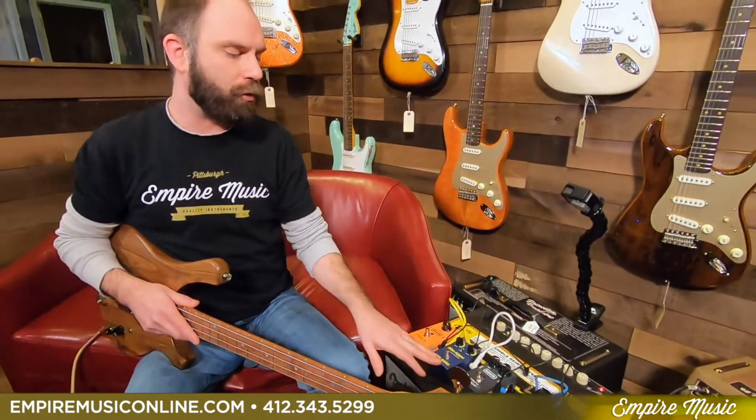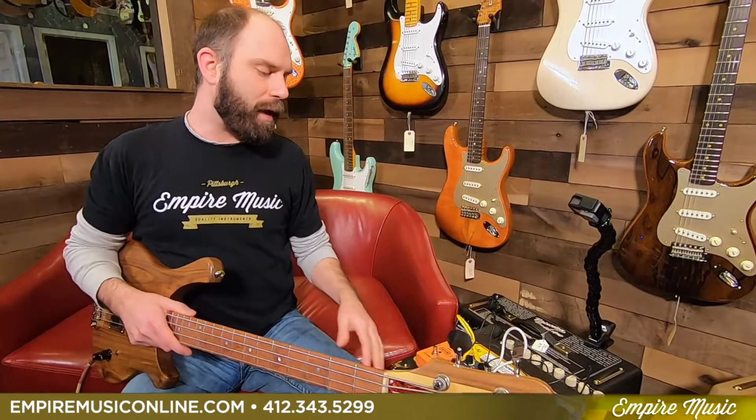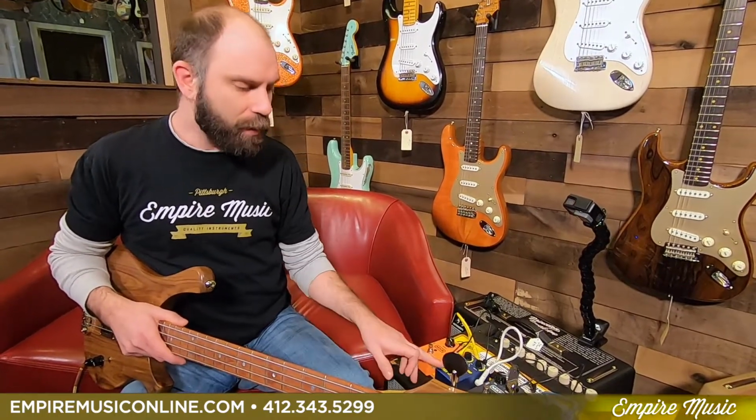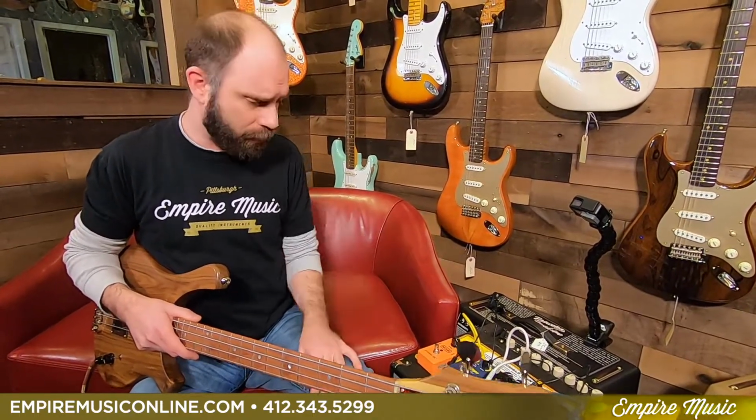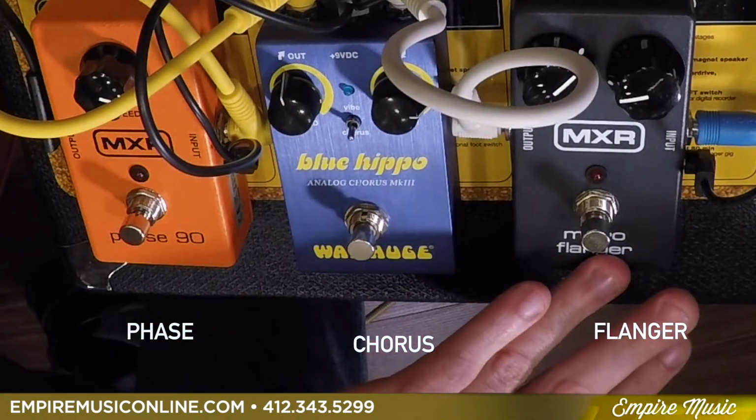What's happening with flanger and chorus, actually, they're delay pedals to some extent. They're just very short delay pedals when we're talking in relationship to, say, a Boss digital delay or the EarthQuaker Devices Avalanche Run, or insert any true delay pedal name there. So what happens with a chorus pedal, this is a longer delayed signal for, we'll call it, the wet signal, the affected signal internally there. Longer delay times. Shorter delay times in a flanger.